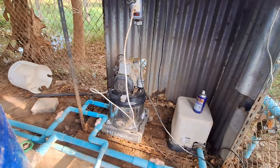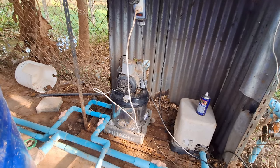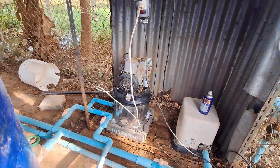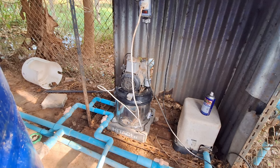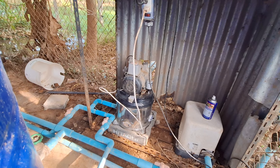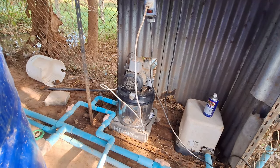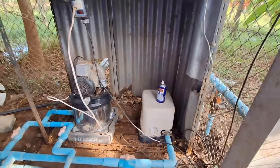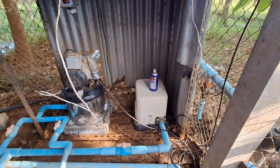The well pump is quite strong, but it's doing two jobs. It's using its wattage to draw from about 25 meters down and to push that water out on the surface. So that pumping strength is somewhat compromised. The surface pump has one job — push it out as best it can — so you get better pressure out of that unit. It's probably the best way to do it.